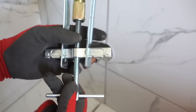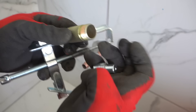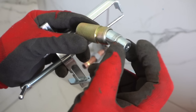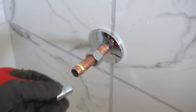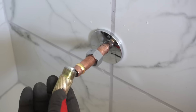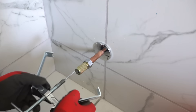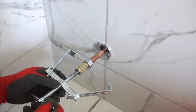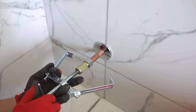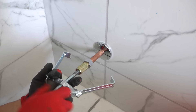What we're going to use now is our compression ring puller. It comes in three pieces: you have the puller, this gold piece, and this little piece right here. What you want to do is insert the small piece on the inside of this gold tube. The purpose of the silver piece is that when you insert it through here, it acts as a stopper. Insert it through that gold piece, put it through here, and you're going to screw this on. Take your puller, insert it through that gold piece, and now you're just going to keep twisting this until you feel resistance, and you're going to slowly see that ring getting pulled out of there.